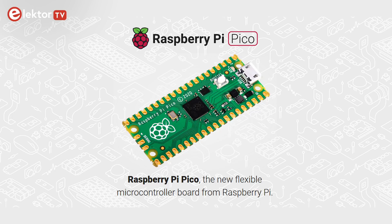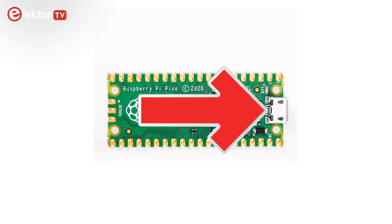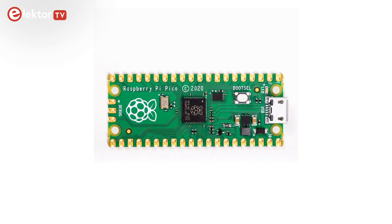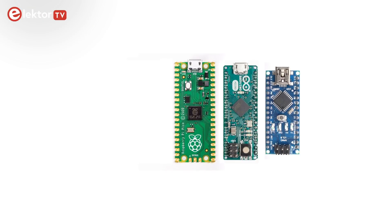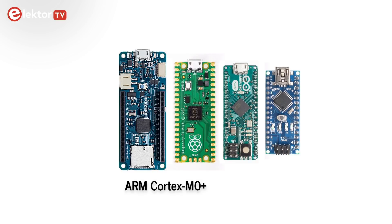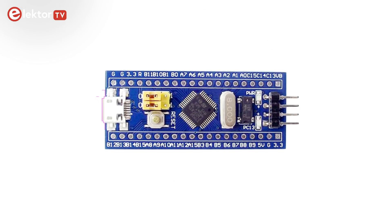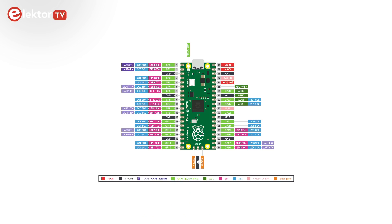The Raspberry Pi Pico is the first microcontroller board based on the RP2040. It is aimed at both makers and volume applications. It has the MCU in the center, a micro-USB connector on one end, a row of contacts along each side, and a 3-pin debug connector at the other end. The Raspberry Pi Pico measures 51 by 21 millimeters, the exact same size as an ESP32 Pico kit. It is slightly larger than an Arduino Nano or Micro, and a bit smaller than an Arduino MKR0, which is also based on an ARM Cortex-M0 Plus device, but single-core. The RPico retails for around 5 euros, similar to the STM32 blue pill board. It comes with 2 MB of QSPI flash memory, and 26 of the 30 GPIO pins on the RP2040 have been brought out on the extension connectors.